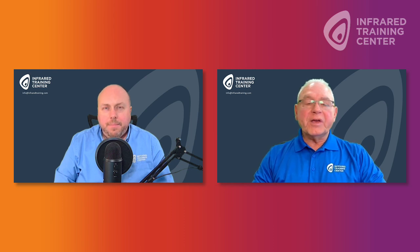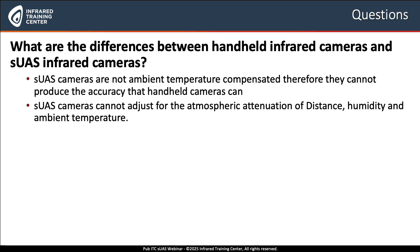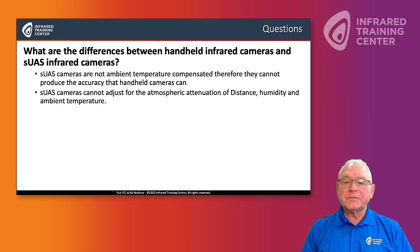Well, that's a question we get quite a bit, Matt. And it's important to remember that an sUAS infrared camera is not ambient temperature compensated, so it won't be as accurate as a handheld camera. We have more challenges collecting the data from the air, greater distances, more wind speed typically, more ambient conditions. By the way, sUAS infrared cameras cannot adjust for atmospheric attenuation, distance, and humidity. So even though we collect a great image and we put it in the radiometric software, the cameras today do not collect those variables for increased accuracy.